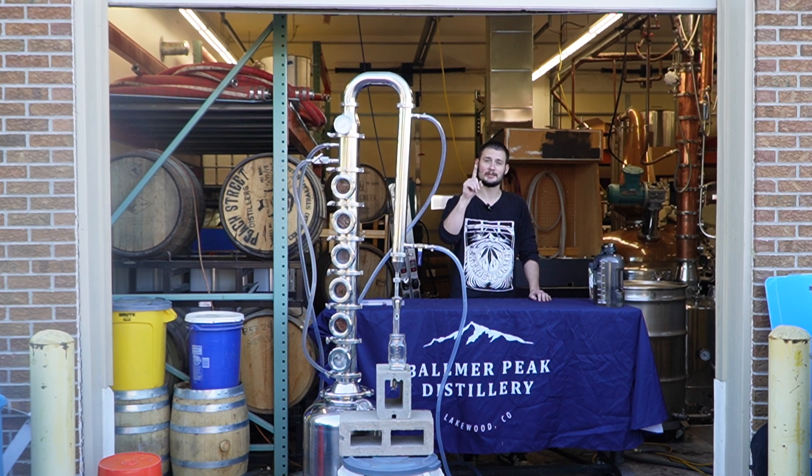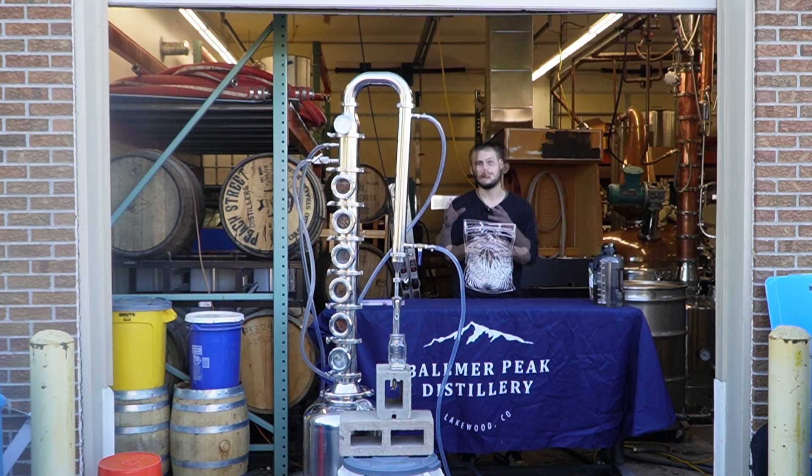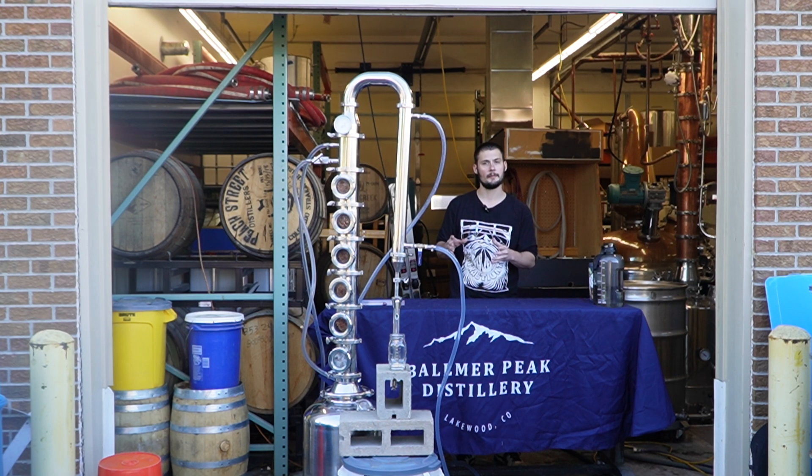We know because we've tried — I didn't just make one of these, I made three. We tried stripping runs, post-processing, post-infusion, oak aging, and nothing quite did it. So today I'm standing here with this beautiful plate still. These are for very serious hobby distillers, as well as professional distilleries. They have plates between each section, and each section is capable of basically another distillation. We've given up trying to get flavor out of this — at this point we're just going to try to correct it into a neutral spirit, a very pure, clean one.